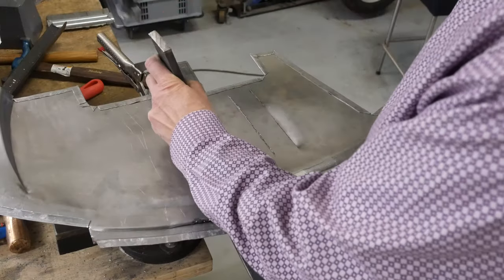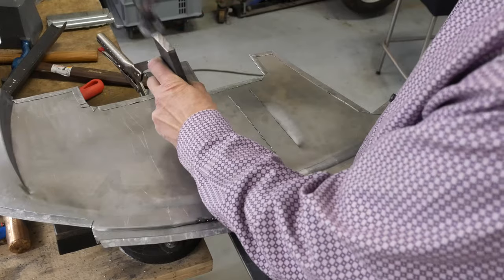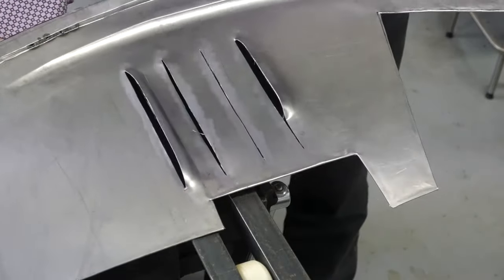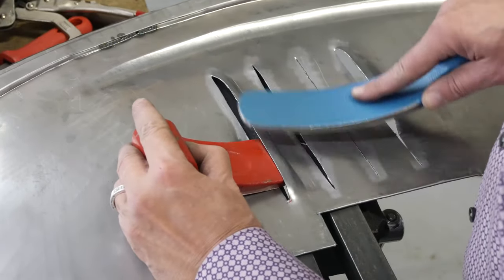With a stamp, the bead is driven into the final shape. Two L profiles clamped together in the distance serve as a base. Use a flat anvil and a spoon to shape the surrounding.